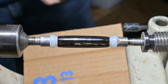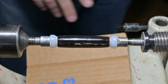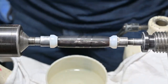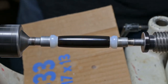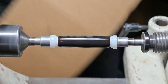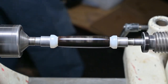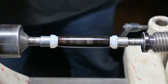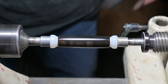So here we go. All right, it's 11:24 the next day. We're gonna try something new and put that coat of CA finish on there. I'm just gonna wet sand. I got a new bottle of Mercury Flex Thin, and I just put 8 coats on here. We're going to now attempt to smooth it out. And again, I'm only gonna use 320 and 400 Abranet, very light, and see how well we do. This time, fresh bottle of CA glue.